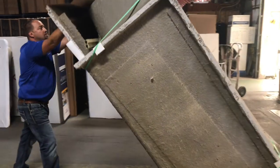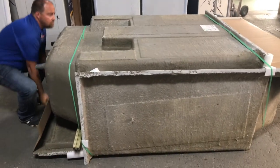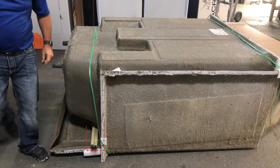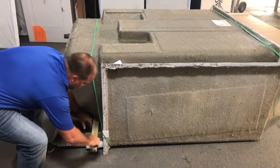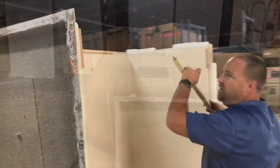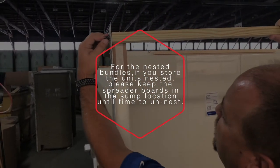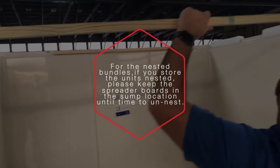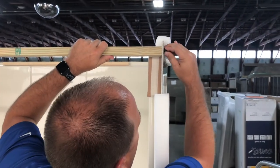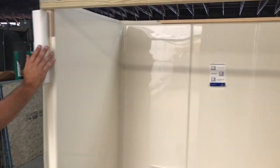You will need spreader boards for nested units. Spreader boards — two per nested bundle — will be located in the sump between the tub cavity and the skirt wall. The spreader boards accompanying each nested bundle will fit the two tub showers. If you store the units nested, please keep the spreader boards in the sump location until time to un-nest. Once the units are un-nested, the spreader boards must be attached as shown to the units to help support the sidewalls from bowing and cracking.